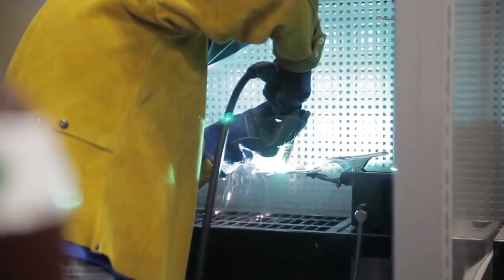Part of the issue we see with technicians is the time — are they taking the time to do test welds? Doing that takes time, and technicians are usually compensated for that time as well. If they're not being compensated to set the machine up and do the test welds, they absolutely should still be doing the setup and test welds. But it may get overlooked if they're not making sure they're getting time that adequately lets them perform the test welds and setup.